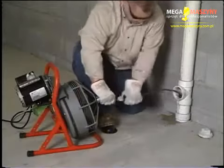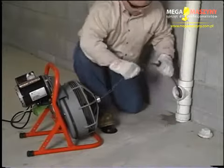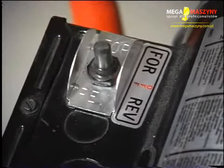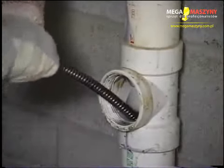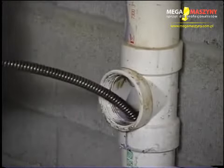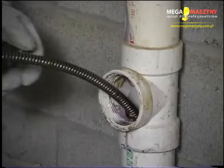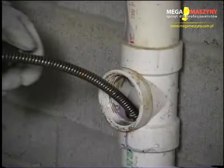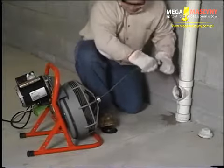To retrieve the cable after the drain is cleaned, release the foot actuator and allow the machine to come to a complete stop. Turn the machine off. Pull one or two feet of cable from the inlet at a time and manually push it back into the machine. It may be easier to do this when the drum is not spinning. Continue this procedure until the tool is just inside the inlet. Warning: never retract the tool from the sewer inlet while the cable is rotating. With the machine off, pull the remaining cable and tool from the line and push the cable back into the machine.